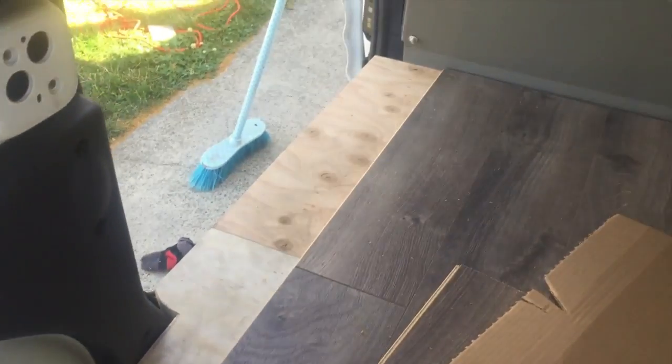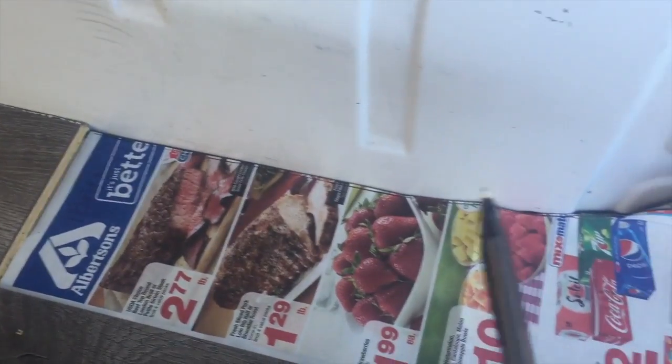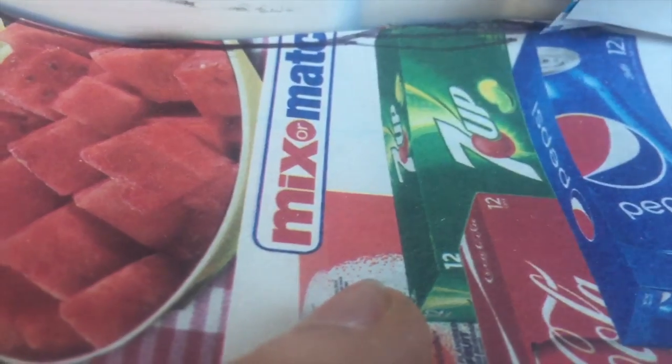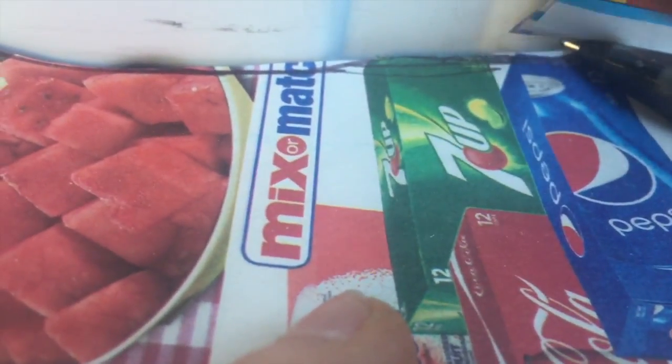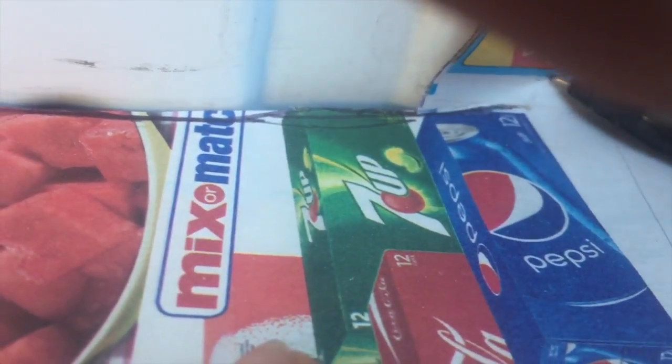The other side over there should be a lot easier. I got all the pieces in and everything looks pretty good. I want to show you how I'm making my templates here - I get pieces of newspaper, get them in position, take a pen, lay it flat, and push it against the wall to trace the contour.